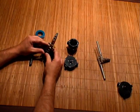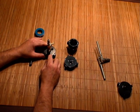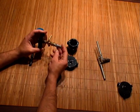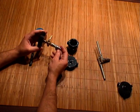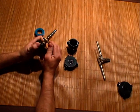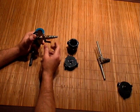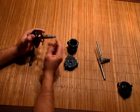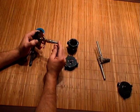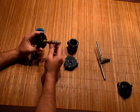That's your hose inflation setup. You'll notice the big difference is that you don't have a safety relief valve, so it's critical that when you use this in training you throttle down your compressor so it won't inflate the hose to more than 40 psi. If you're unable to turn down your compressor, only inflate the hose enough so that it gets its normal shape, then shut off and disconnect your air shoreline fitting. This setup is used off your fire apparatus air shorelines, not the air bottle, unless you make a fitting for that as well.